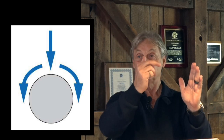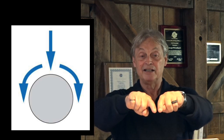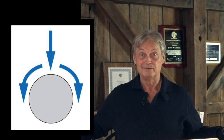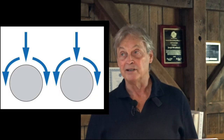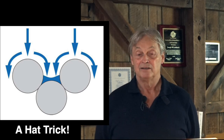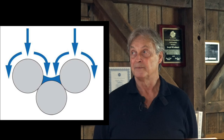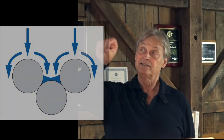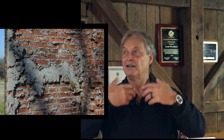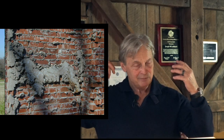If water leaks through the brick, it's going to run down the back side of the brick and hit the hockey puck, then drain to each side. We don't develop any pressure because the water is draining away. But if I have two hockey pucks — or three — I collect the water and create hydrostatic pressure. When that water is a half an inch thick, it's equivalent to a 35 mile-per-hour wind. I can get hurricane-force winds in the absence of a hurricane simply if I don't drain the water. If I don't drain the water, I get insanely powerful loads.